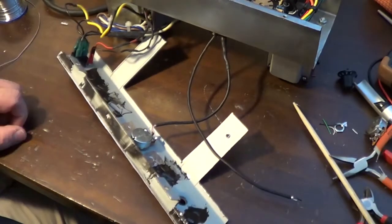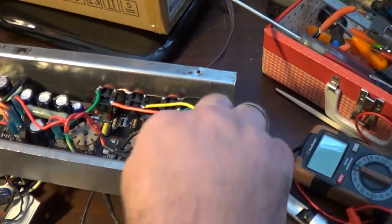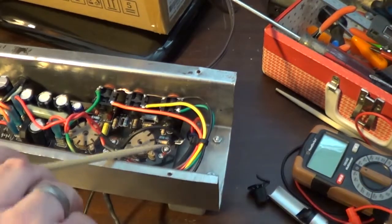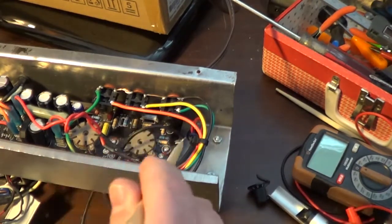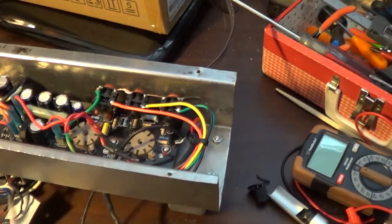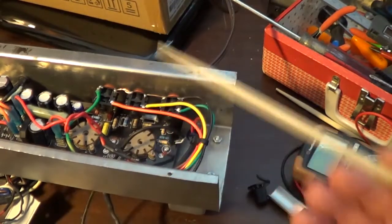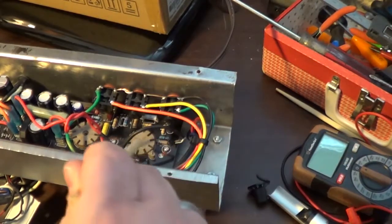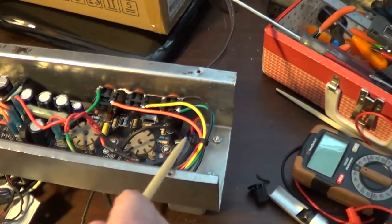So what I'm going to do is attempt to cut the non-insulated lead at this end, taking the foil and the grounding from the foil all the way out of the system at first. We're going to do that first, because right now all the foil that's in here that's supposed to be shielding this is connected to the ground plane on the board itself. So if I disconnect it from this end, there will be no shielding in this.